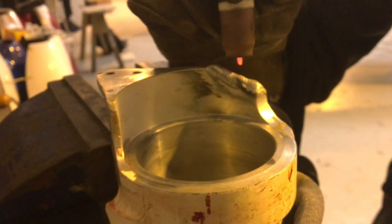I'm just going to have to stab metal in like crazy and back off the heat to try and keep the puddle cool and try and build up a bit on the end. Strange stuff, cast aluminium — you have to just take your time, let the cleaning action do its thing, and it sort of works.